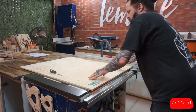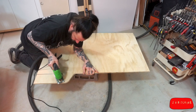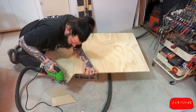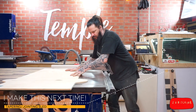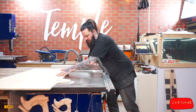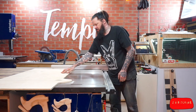To start it off, I cut the outlines on the table saw, then switch to a jigsaw to join the curves. For this next bit you should raise your blade up into the workpiece, which should be weighted down. What I'm doing is cutting the kerf using my fence, which I know is aligned properly. I'm not cutting from the ends because of the design of this sled.